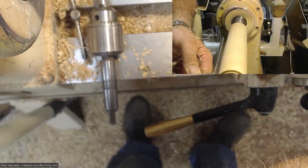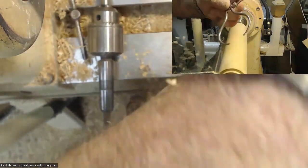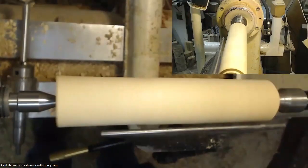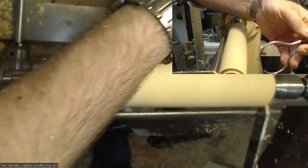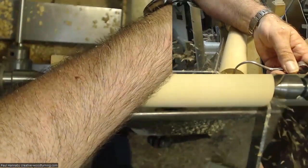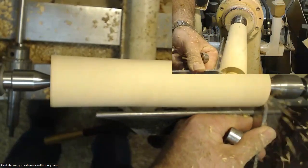So I'll square up this bottom and then start to take my first cut. Paul, can you change cameras? Just let me raise this camera up a little. That's better. So I'm going on the end with the parting tool and then I'll put the calipers over it. So that's just down to the right diameter. I said earlier, I'm going to make my spigot an inch long.